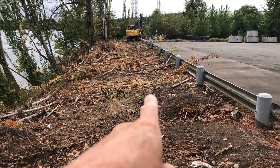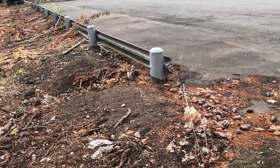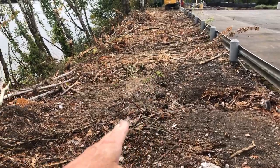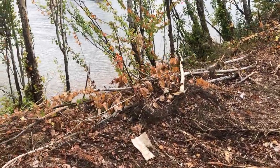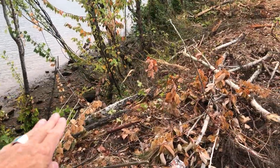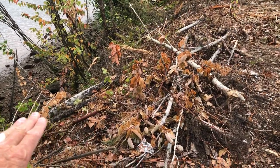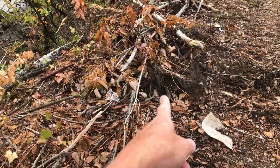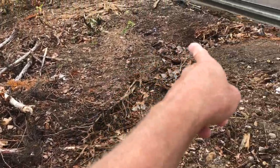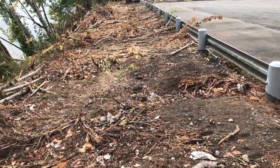This is part two of the inspections. What we're doing is cutting a slope down to tie into the riverbank below and create some nice intertidal habitat. The bank will cut down to a two-to-one or one-and-a-half-to-one slope back up to the property line. We're doing this for 1,200 feet of riverbank on this project.